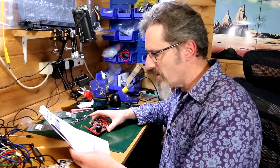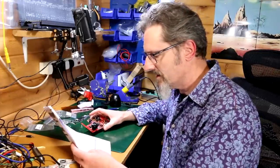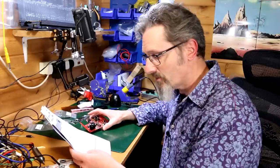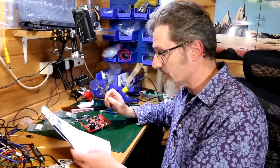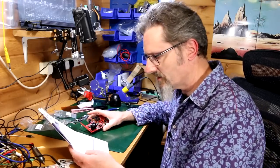The components must not be soldered, it says, until they are placed on the PCB and fully attached to the front panel. Two reasons for this. The height, the panel components are not all the same. Because of this, if not attached properly before soldering, they will not stay properly seated against the panel. This might cause mechanical stress, reducing life expectancy. What, my life expectancy? In the worst case, cause them to break.